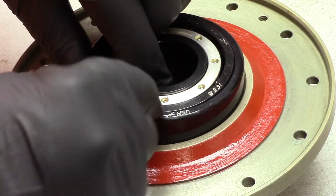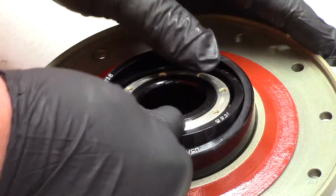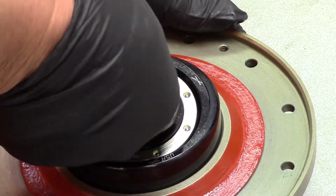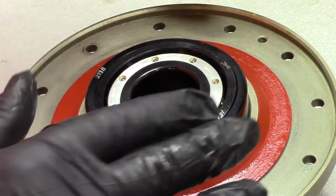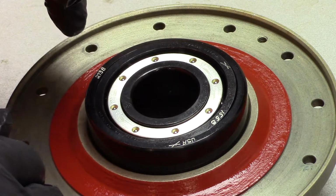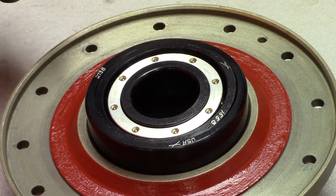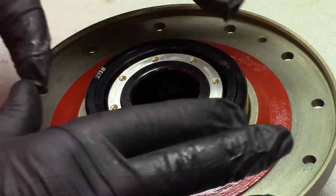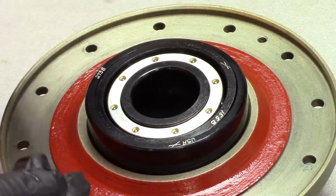All right, as you can see, this bearing, you can just about press that in there with your fingers, however you cannot. So generally what we'll do is we're going to heat this housing slightly in an oven, warm it, which will allow this to expand, and then this bearing will basically just drop right in there. The bearing we will obviously not put in the oven, keep it at room temperature, heat this housing, and you'll have a slightly larger housing bore here. Bearing bore will increase a little bit because of thermal expansion and allow the race to drop in. Once it cools, it'll be in there.